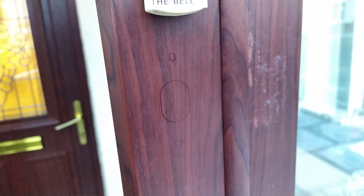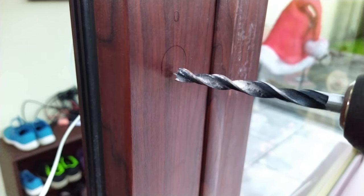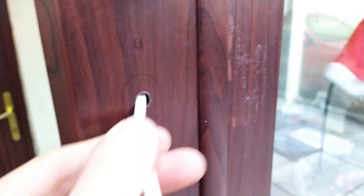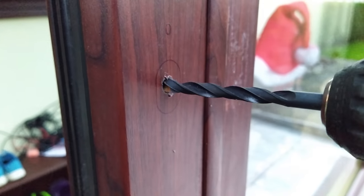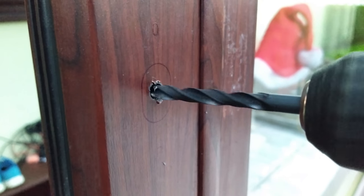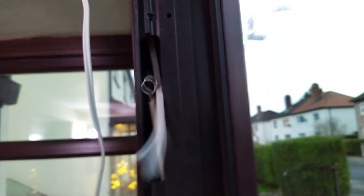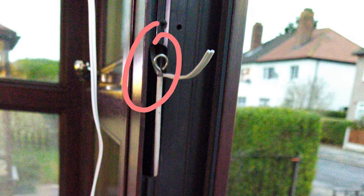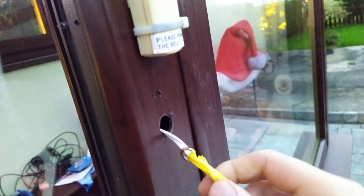For the wire's route from inside the frame to the external side, I first marked out the location of the new doorbell just below my old one, took a deep breath and drilled the first hole through the plastic. I then tried to thread a cable in and up and confirmed it was in a different internal chamber than the bits at the other side. So it was time to switch to a metal drill bit and cross my fingers before continuing to tunnel through my door frame. In the end I had to go through not one but two metal sections, but after that I was able to poke the hook in and up and it appeared inside the chamber behind the doorkeep. I hooked it over the cable, secured it with some electrical tape and pulled it through to the outside. The cable now runs in behind where the doorbell will go, through the two holes in the metal structure, up inside and comes out right at the top on the inside.